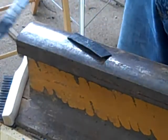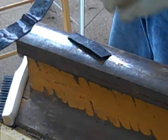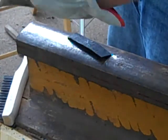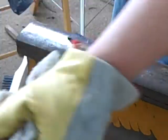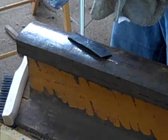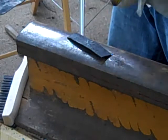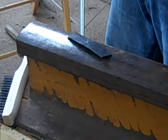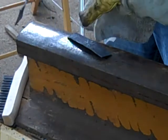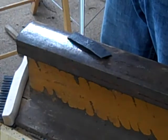This is a piece of low carbon, mild steel that I got from the hardware store. I've also heated this up past non-magnetic and quenched it in water. What I want to do right now is hit each of these with a hammer and look at how much fracturing happens. I would expect this O1 steel to just shatter. If this mild steel shatters, then I know it's hardenable — it might not get as hard as the high carbon tool steel, but if it shatters, I know I can harden it.